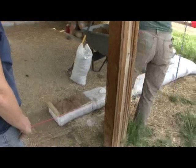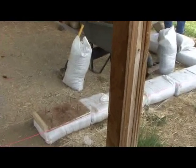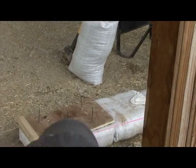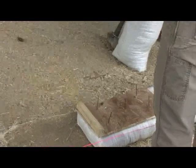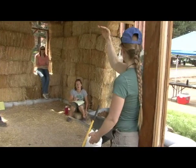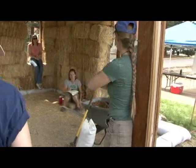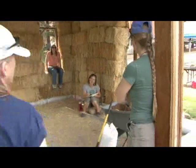And that's for like a door jamb? Yeah, you would do that. If this was a door opening here, and you were going to want to put a door frame, like a rough buck in here, you'd put strip anchors, maybe every third course. That would be your anchor point to put your door frame in. The same with a window frame. You could do that as well.